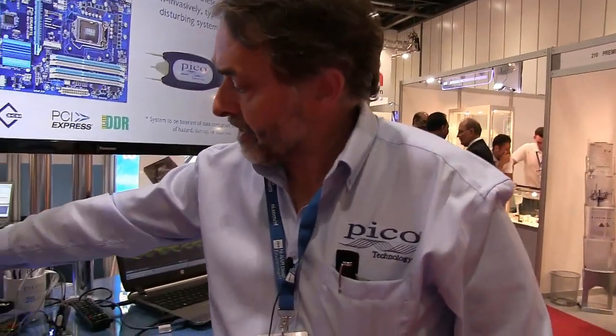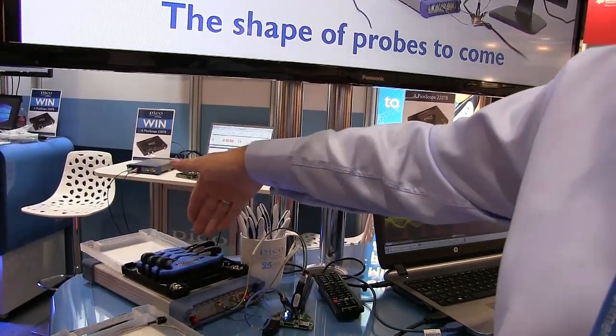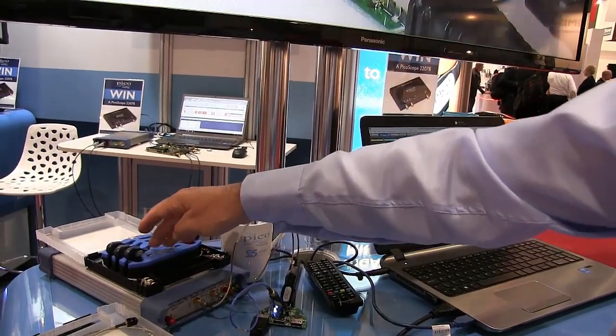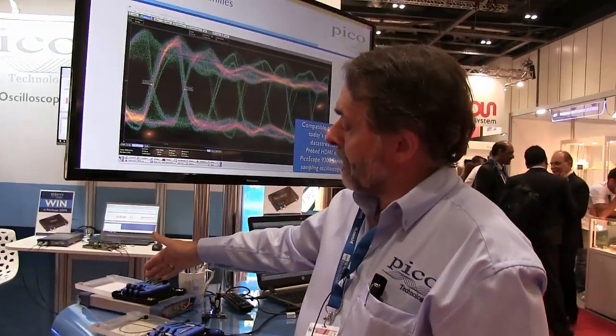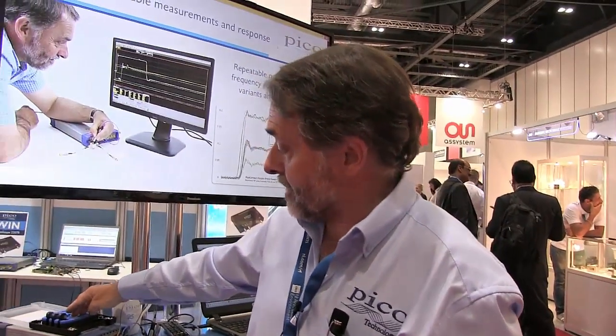There are two families here. At the back, the 910 series of probes: six probes, three division ratios, two couplings. These probes are aimed at analog, RF, and pulse applications, starting at about 4 gigahertz through to 5 gigahertz bandwidth. They have higher load impedance — 200 ohms through to 1,000 ohms. They have higher voltage capability up to 14 volts RMS and a high peak voltage capability up to 150 volts peak, as long as the 14 volts RMS condition is not violated.